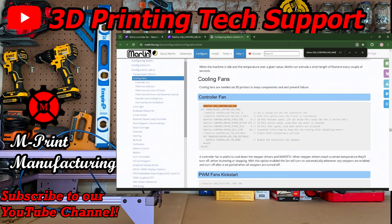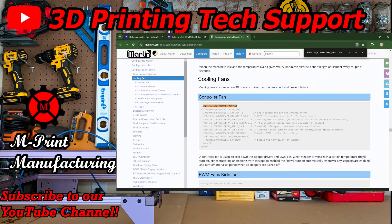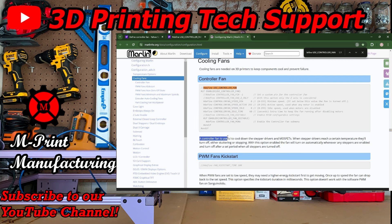It's going to be a firmware-heavy solution. In Marlin 2.0 — basically the firmware that is controlling your 3D printer — you can create a cooling fan from the defined used controller fan code in the advanced configuration section. This is going to be the key to getting your lights to be: one, powered by the board, and two, turning off when the machine stepper motors are idle.